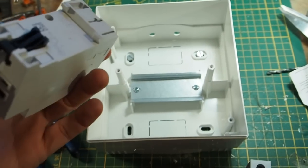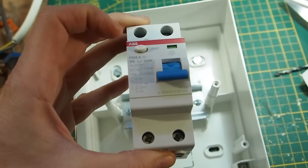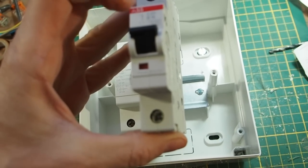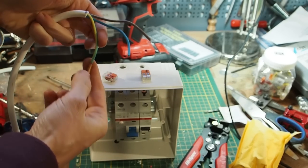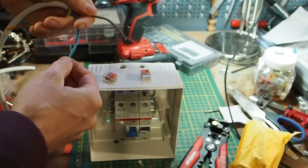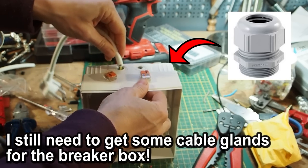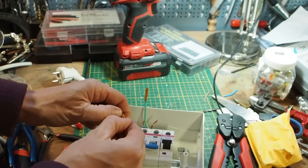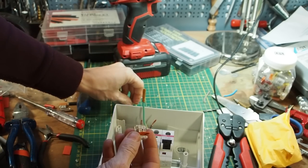This is the box I've just taken out of my cart. Here I have a 25A RCD, and then I also want to use a B16 breaker. Because the IT network of the inverter does not provide a ground, I don't need the earth wire here — I just insulated it off and I'm working with just the neutral. I'm going to use these WAGO clamps, which can clamp both single-strand wire and really fine wire. You just open up the clamp, insert the wire, and close it again.